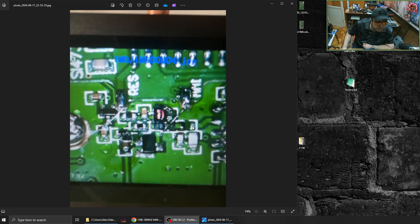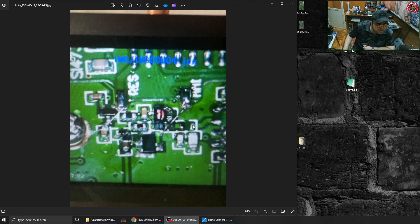So you see they take this capacitor off — they know how to take this coil and capacitor off, and it's much easier to just take one capacitor off. They take the antenna-in signal from here. This coil is an interesting thing — I don't know exactly what it is or why they have it. This is just a regular jumper — we jump it from here to here, but they decided it's easier to jump it right here. There is a contact going from this resistor to this transistor and to this capacitor, so you can connect it here, here, or here — doesn't matter.